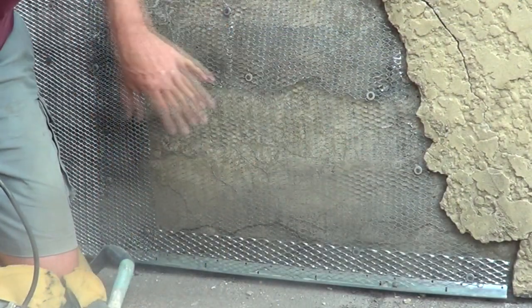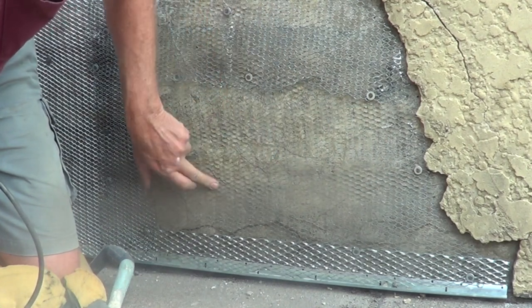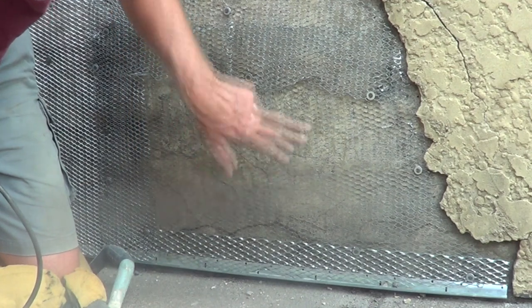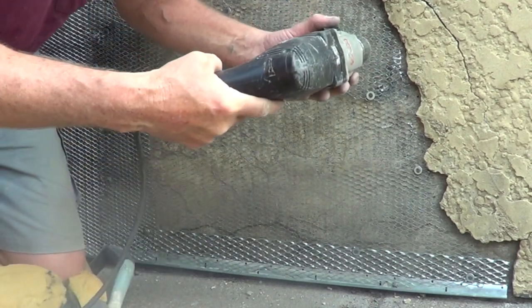So you're going to say to me, Mike, how often do you put these nails in? See where it's bumpy? I usually put them in about six or seven inches apart, sometimes eight. Or anywhere that it's bumpy — see that? I want to fix that. Anywhere it's bumpy.